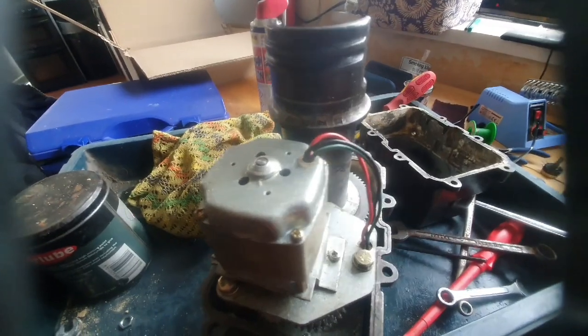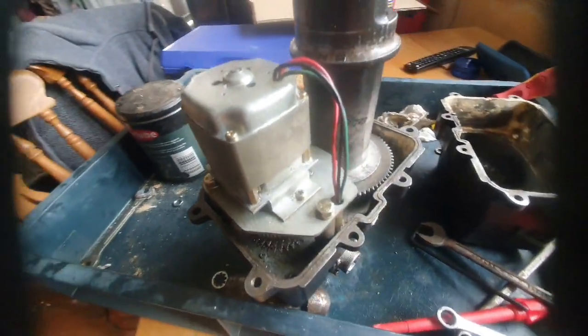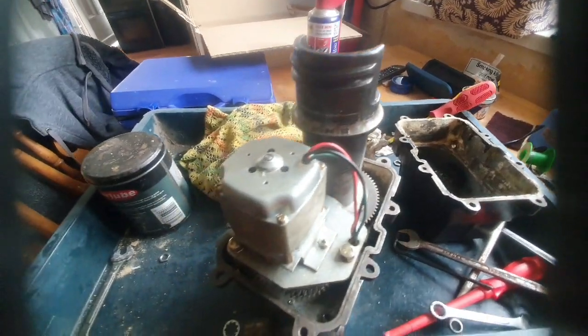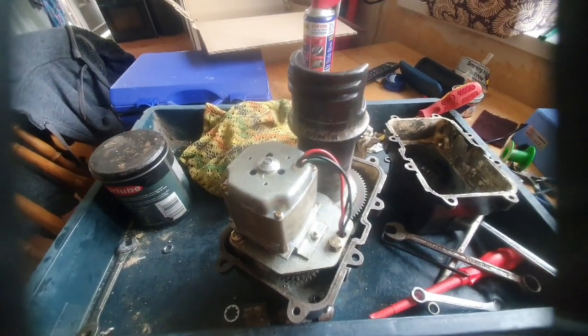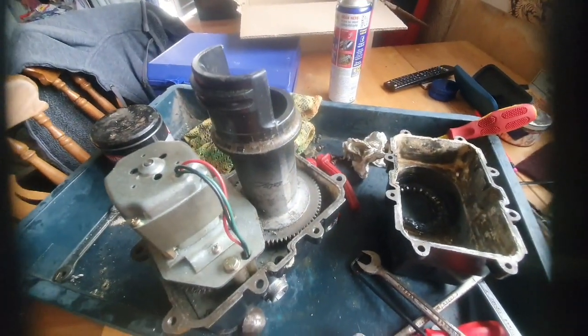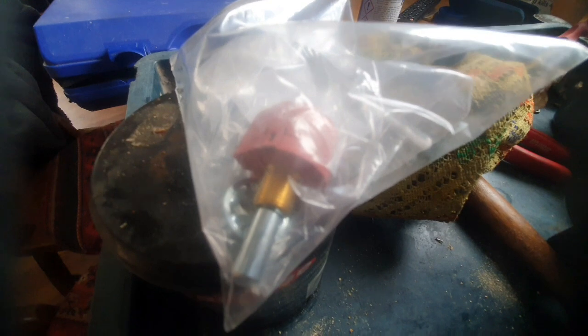We're going to build it back up again and then look at building a new antenna. A quick look around the setup — it strips into two pieces quite easily. There's a bit of a clean-up before I reassemble, using some high-resistance grease. The soldering iron has been in play. I'll show you the replacement pot — it's just a 500k pot. I've used one of these previously and they work really well. They are wire wound, which is the older design, but they still seem to have a good lifespan.